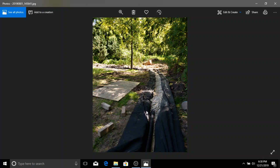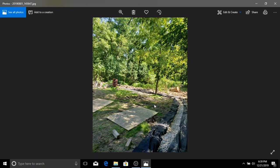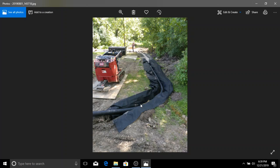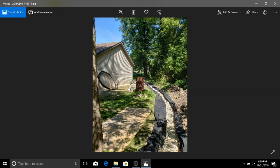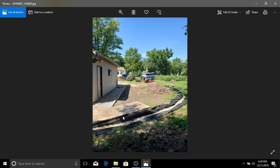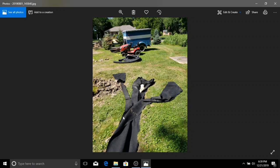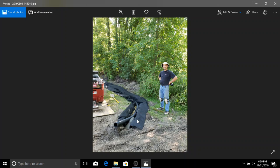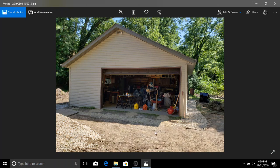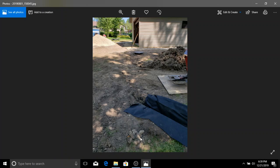Going around the back of the yard and starting to fill it with inch-and-a-half round rock all the way through. Making a connection with the Easy Drain wrapped in filter fabric. I used the Toro Dingo to fill it, sometimes a wheelbarrow depending on whether I was in tight quarters and could use the skid steer. Got it all full of stone — looking nice. Starting to wrap it up. Most days I was working alone. I got the clean out built, using plywood constantly because it was still muddy. Making the Easy Drain connection that goes underneath to the sump pit.